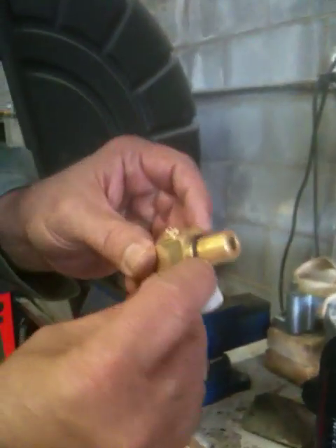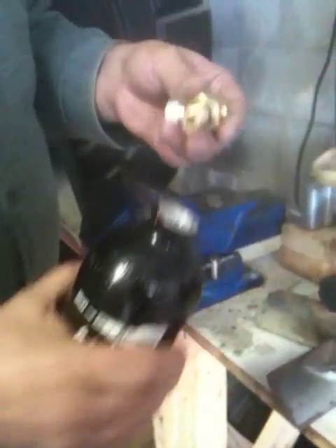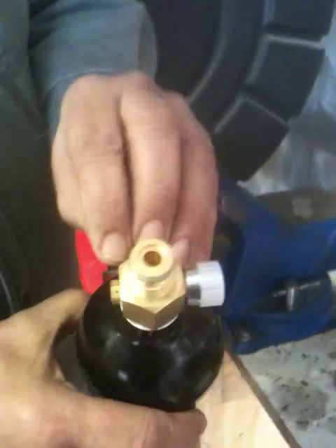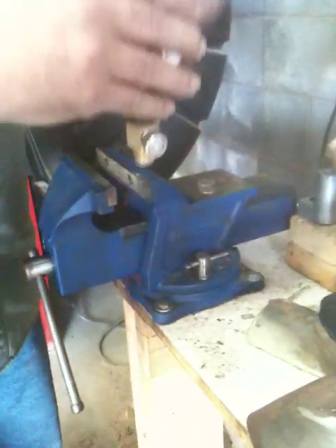Now we get the on-off valve. Like I told you, there's a little sealing ring on all of these valves. This sealing ring will do the job that it's supposed to do once this is installed on the tank. So screw this in there. This is not something you're going to go after with a wrench and try to tighten up — it ain't going to happen. You've got to tighten this one on with a vise and a strap wrench, just exactly like the other. You've got to be careful — you don't want to hit your 3,000 psi pressure relief valve. That's there for a purpose, to keep your tank from blowing up if it got too much pressure inside.